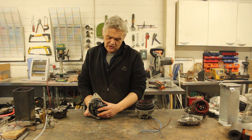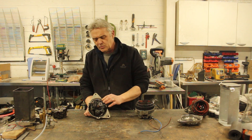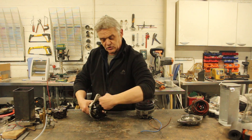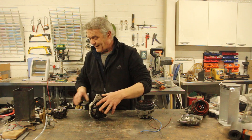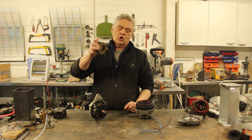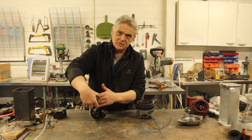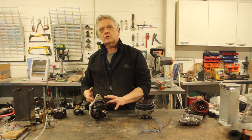This differs from motors and other generators in that normally you see the coil oriented one way. On these, the coil is wound around like that — it's just a coil sitting in there — and that means that one end is permanently north and the other is permanently south. So the top of these poles are north and south.